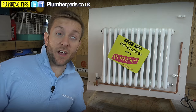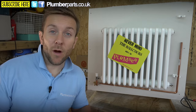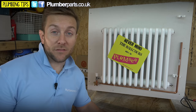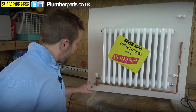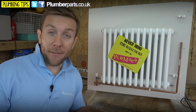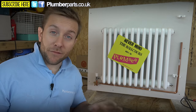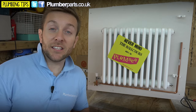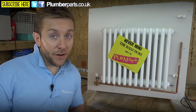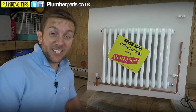Now the two fixes we've just done were nice and easy, because they're on what I call the dead side of the radiator — the side you can valve off from the rest of the heating system. But this leak here on the lower nut, unfortunately, you're not going to be able to valve off. I would say every time: if you're not happy about doing any of the work on this particular part, get a plumber in. Because if you're not quick enough and don't know what you're doing, it's going to require you to drain the whole heating system out, re-inhibit it, and so on. But if you're lucky, you might be able to do this quickly — just set yourself up so if you do start to get a leak, it's not going to ruin your whole house.